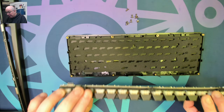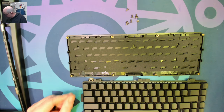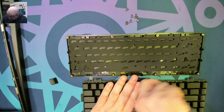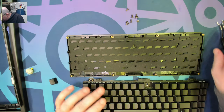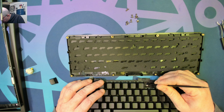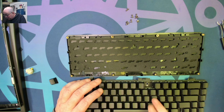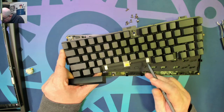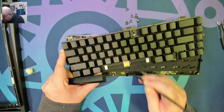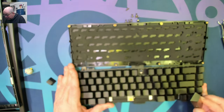But between the USB port being on the PCB, the really thin body and cover, and the basic switches with no choices for others, and it looks like we do have an IXPE layer, but that's it. We don't have IXPE and PET, we just have IXPE. So at least there's screw-in stabilizers, and it does look like we have what appears to be a reset button. Is it a button? Yeah, it's a button underneath the space bar. So that'll put you into flash firmware mode.